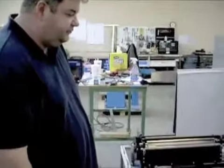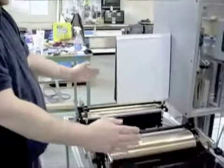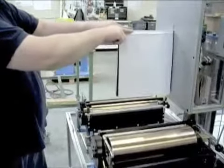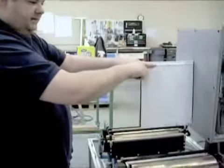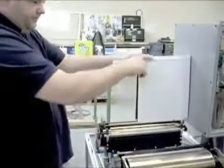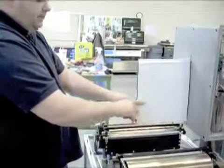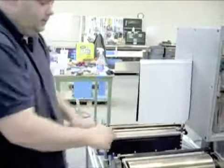There are two sensors on the machine. When the wing is going down, one sensor will trigger the rollers to come in so they can back-roll up the book, or you can have them come in and hit the spine. When the wing reaches the bottom, the other sensor — as the wing comes up and the rollers roll down — you can have the rollers open up anywhere along the book. We change that with these sensors in the back.